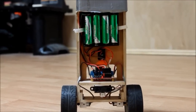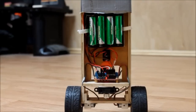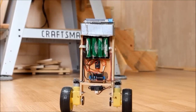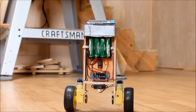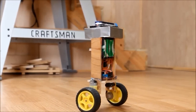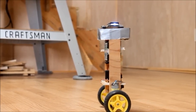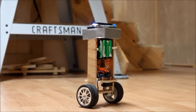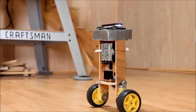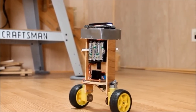You might ask which wheelset makes the better balancing robot. Clearly both are usable. Personally, from an aesthetics point of view, I lean toward the N20s, and they consume probably a third of the power, so batteries last longer. But they're not nearly as powerful as the cheaper yellow set and take more finesse to fit to a car. Their open frame can be viewed as both a plus or a negative — a plus if you like to see moving parts, but negative if dirt or lint might be a factor. The yellow plastic motors are easier to mount and can be had for probably half the cost or less when you add in wheels and mounting hardware. The yellow set will allow you to run the car over a wider range of terrain, so I think it's really a toss-up and should be your call as to which is best.